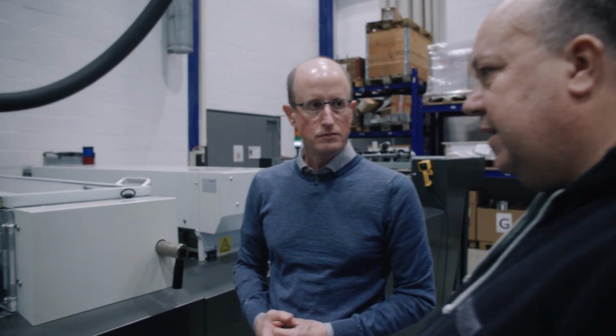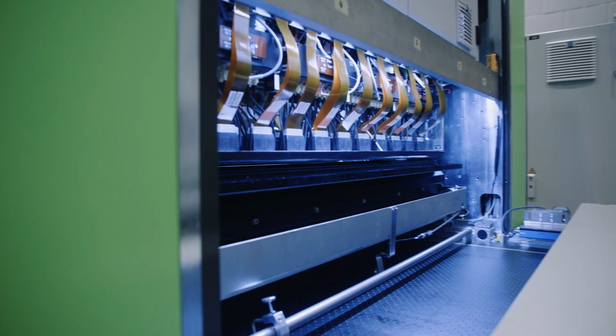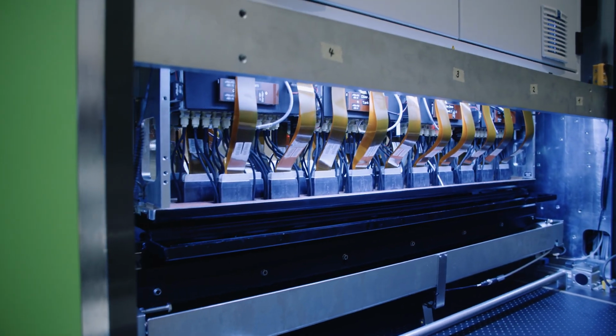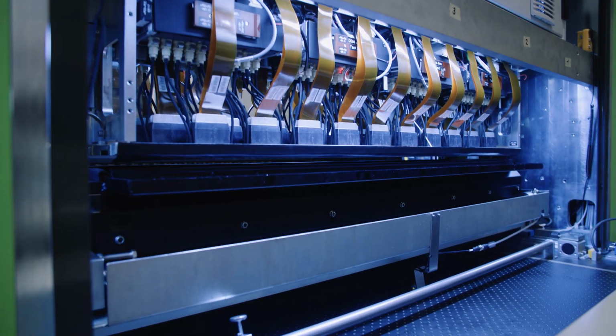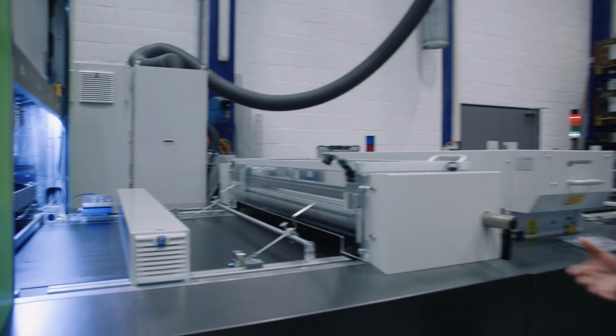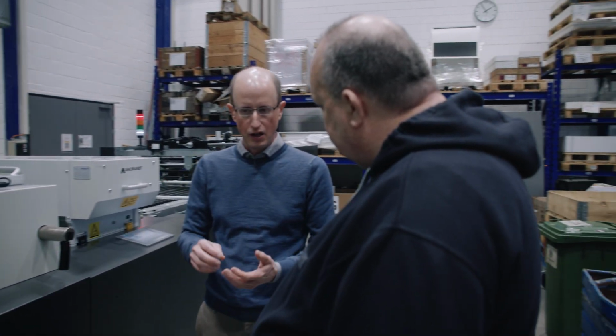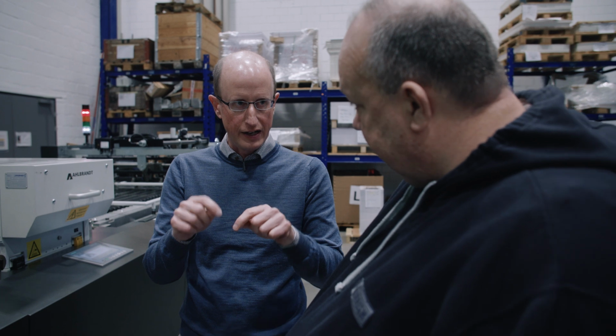Exactly. And because a lot of people today want gloss varnish and matte varnish, is that something the machine can do? Yeah, it's always the gloss varnish, but if you do grayscales in the pre-press, and you get an open structure of your image where these little dots don't merge together, then you get a matte effect.